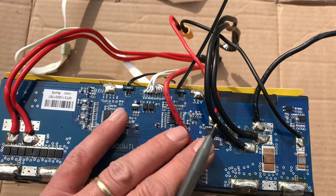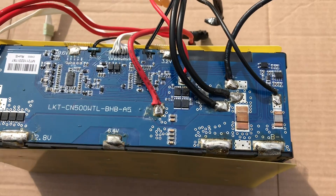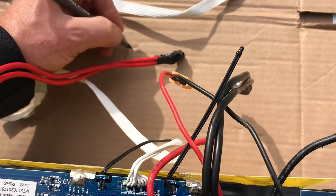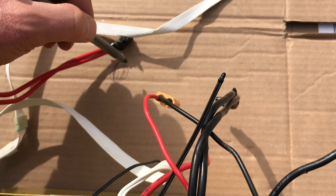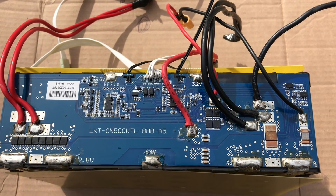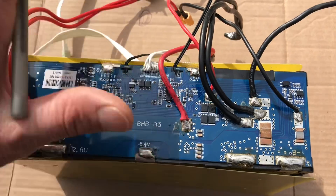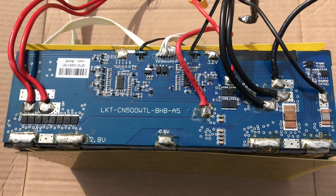The battery voltage is always hot to the BMS — that's strike two against it. There's no way to disconnect it without opening the battery and removing the BMS. You can put a regular surge protector on the external wires at a terminal block. A DC terminal block with the fastest-reacting surge protector you can get — Midnight Solar's DC ones are rated around 15 nanoseconds. That'll protect the wiring, but the BMS is still under just a thin sheet of plastic inside the battery.